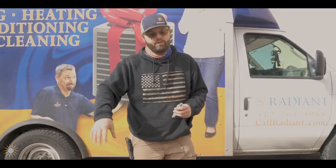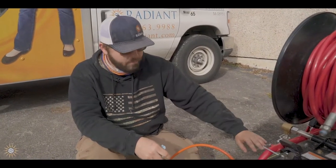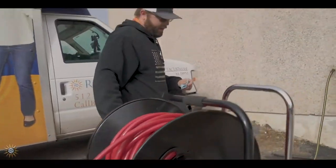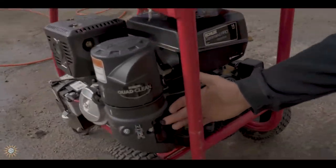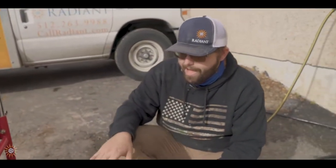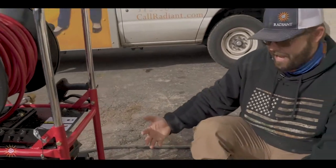Now with the hose selected, tip correctly put on, and the system purging, we're going to get set up to turn the machine on. You always want water going to this pump while the machine is running - no matter what you're doing, if you're changing tips or anything, if you need to turn the machine off, turn the water off last, but always make sure water is going to this pump. Coming to the other side after pre-checks and confirming fluid levels, you'll see the choke on/off switch up top and your gas on/off. When transporting the machine, you want the gas in the off position.